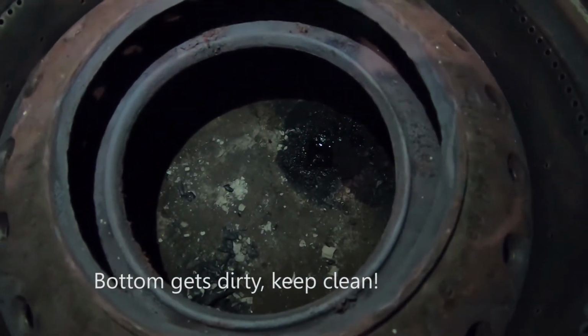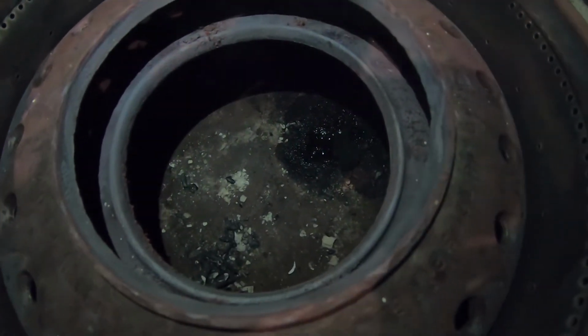And in the back of the oil pan, where the line comes in from the carburetor, there's a hole probably the size of a straw. And that's where the oil slowly trickles in. So you want to make sure that's unobstructed, or else your oil will not fill the pan properly.